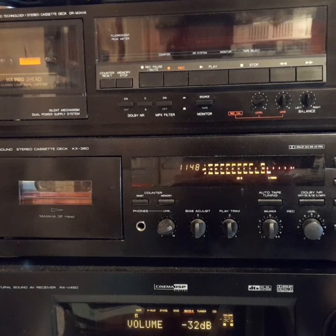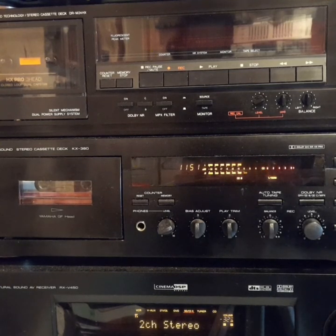As outlined in the notes, the level of the 1 kHz band is adjusted according to the Fletcher-Munson curves to account for changes in the ear's response at different frequencies. Use your tone controls to make the high frequency band sound as loud as the 1 kHz band. Don't attempt to make all the high frequency bands sound as loud as each other, that's not the point of the test. Refer to the notes for a more detailed explanation.